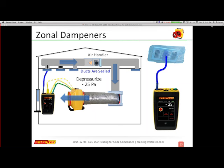So sometimes you actually have a fresh air intake, I'll describe it with my mouse here, that goes from the outside, we'll just say from the roof, into the return. It's what they refer to as fresh air or sometimes makeup air. I really don't think there is such a thing as fresh air. Personally, that's my own IAQ theory, that it's just air from outside. So I have air from outside that's replacing or making up air, depending on how tight the house is or other ventilation concerns.